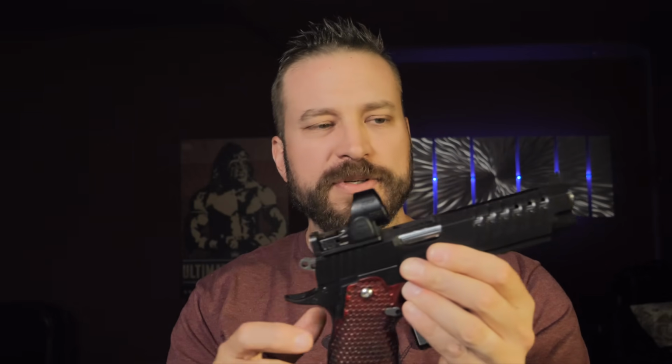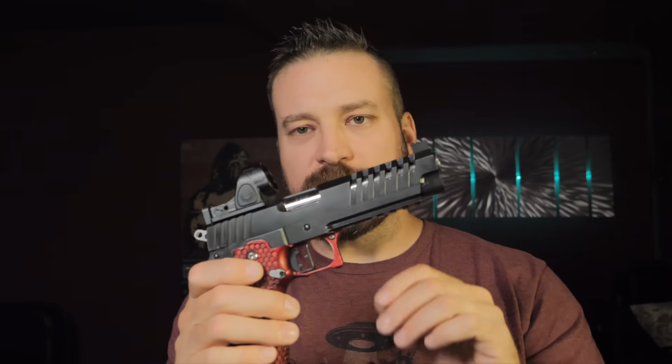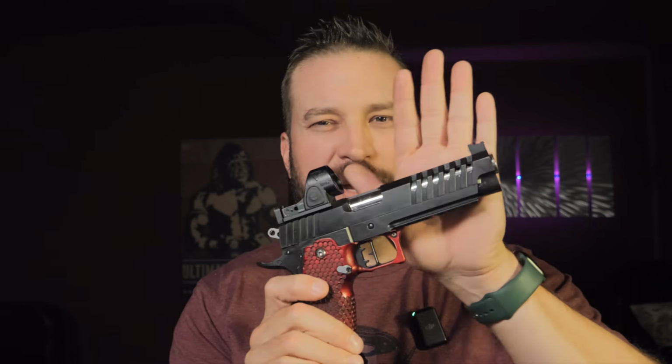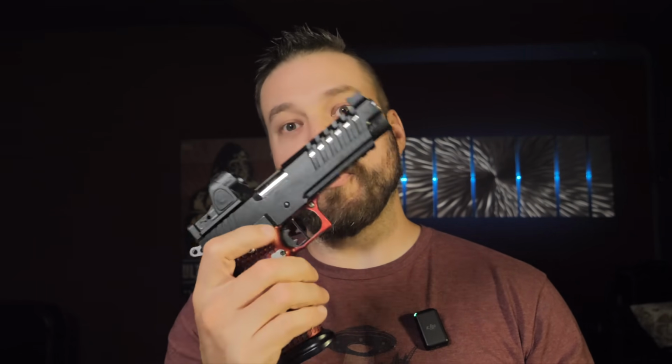And that's kind of the point I'd like to build up, is that the people who are just taking the guns and doing whatever they do to them, you have to realize that the whole gun is a system. You have to visit the recoil spring, you have to visit the hammer spring, you have to figure out the slide cuts. So if the slide weight is down on top of having the ports or the compensator introduced, you balance the spring weight appropriate to the ammunition. If there's a hammer spring, you pay attention to that as well. You optimize the system to behave as one. So I guess that's kind of the analogy. To simply just put some sort of recoil mitigation something onto it without optimizing the whole gun is basically the car equivalent of going to AutoZone and buying a high performance muffler and not actually optimizing the entire exhaust system. It might help some, but it doesn't help as much as it could if the whole system was optimized.